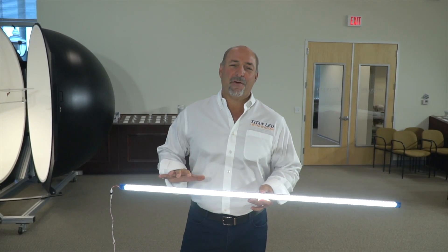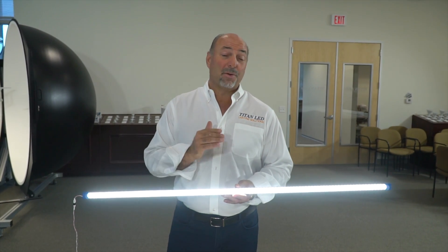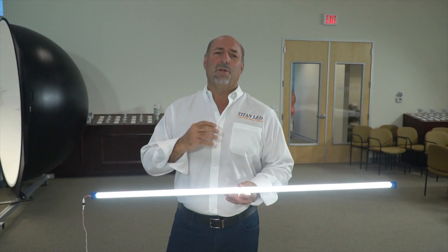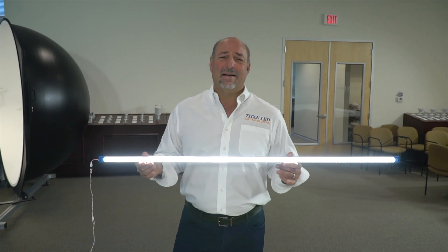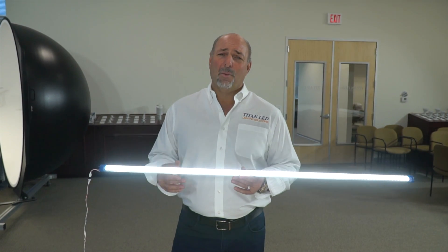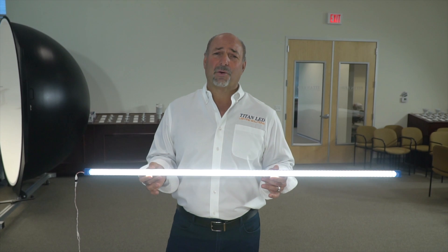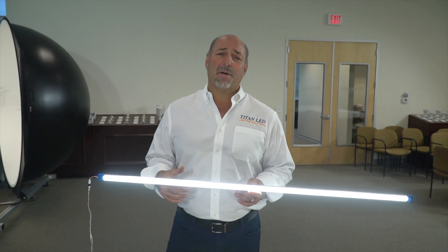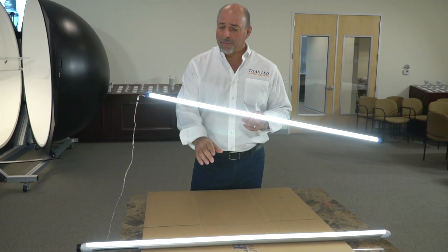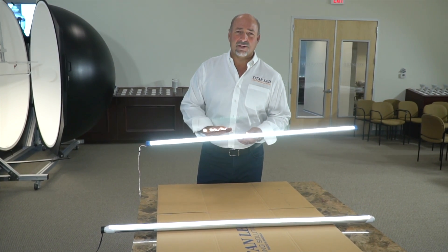What we want to do now is have a little fun. We've taken the technology and slammed it down a couple times over the years. I'm going to do it again today because it is a brand new board, a brand new thermal design, and different LEDs — still in the Lumileds brand, but a different LED. We want to do a little durability test today, make sure it withstands some of the impacts that go on in the field. We've seen a lot of installations where tubes fall from 20 feet in the air. By making a more robust tube, when it does fall and hit the ground, you can pick it back up and use it again — there's absolutely a cost savings in that. On the table here I also have a tube from over the pond. We're going to do a slam test on that tube as well and see if its durability holds up.